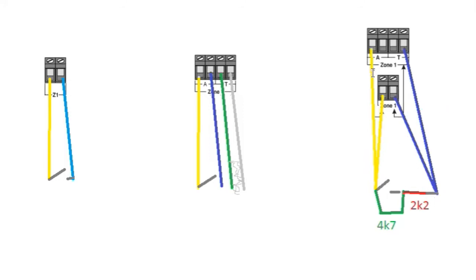And then essentially what's happening is you're getting 2K2 through the tamper and then back into your panel, and that is getting a 2K2 secure zone, which is what the Texecom want. If this was a Galaxy, you'd have a 1K here, and you'd have a 1K here. And then essentially it will come out of one side, through the reed switch, through either the 1K or 2K2 resistor, then back on the other side, okay? And as I said, the panel will see it as a 2K2 secure because the door is closed, so it's again going through the path of least resistance, okay?